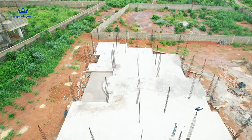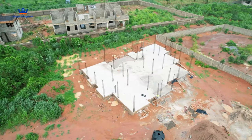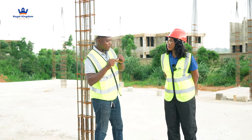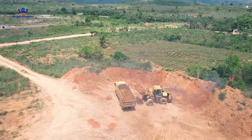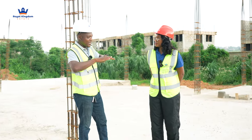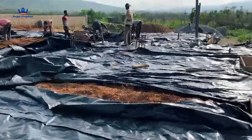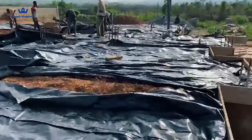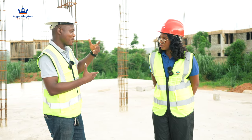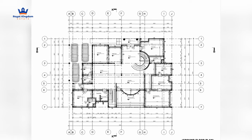It looks amazing. This is the oversight concrete for the bed. We finished with the ground beams, we got the height that we needed. We imported laterite to fill, we made it rain on it, we added water ourselves, we made it dry, we compacted to the level that we wanted. And then we put in the rubber — the bitumen — just to prevent moisture from rising from the foundation to the top. We put in the rubber, we put in our reinforcement mesh, because the structural engineer recommended we put a mesh in it.